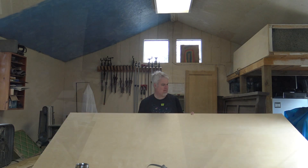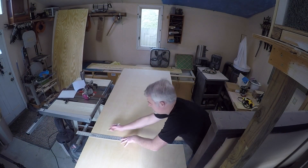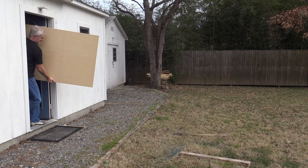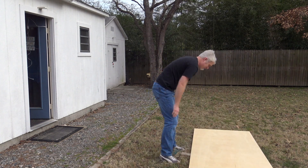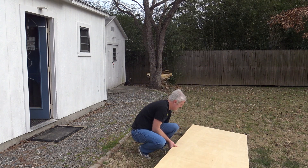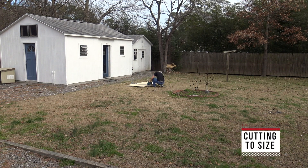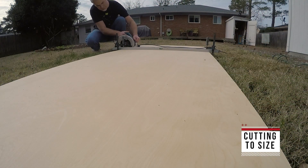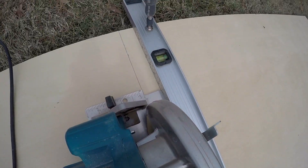What I'm starting out with is just plywood, rough cut at my local home center. I don't have a big enough vehicle to take home a full sheet of 4x8 plywood, so I usually have them cut it down roughly to the estimate and then I cut it down to the exact measurement myself. And before you say anything, I know my yard is a disaster. The first thing I do is cut things down to size using my circular saw. Going outside and doing it on the ground keeps the dust down and is just better suited for my purposes.